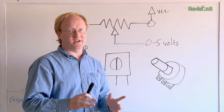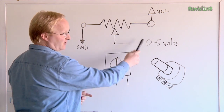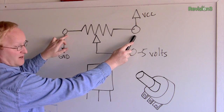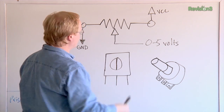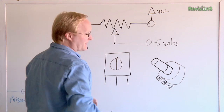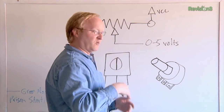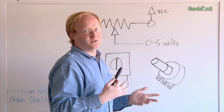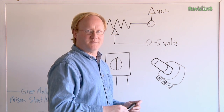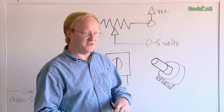We've been putting a lot of adjustment knobs in this project. Each one of those knobs has a potentiometer under it. A potentiometer is usually represented like this in a schematic — it's like a resistor, but there's an arrow going into it. This arrow represents the wiper or the tap or the center. So physically, the two ends of it — if you measure that resistance, you'll get 10K or 100K or whatever your potentiometer value is. The value of this, as compared to ground, will give you a different variable voltage depending on where it is. If it's closer to one end it'll be 5 volts; closer to the other it'll be at ground. How we're using it is with the ADC — the analog-to-digital converter. This tap goes to the ADC, and if it's 0 or 5 volts or any range in between, it assigns it a digital number. We're using an ADC with a 10-bit resolution, so that's 1,024 different positions including 0. Potentiometers are great for fine-tuning adjustments — we take their analog value, make it digital, and use it in our code.